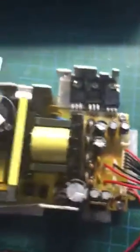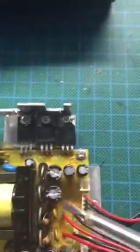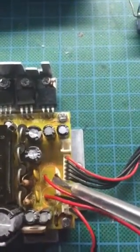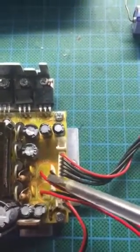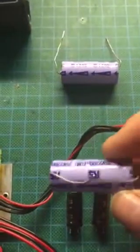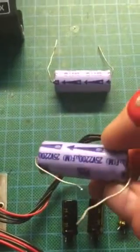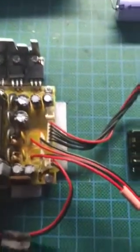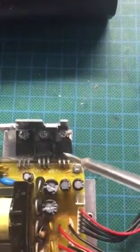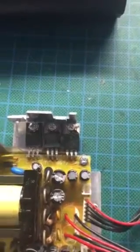What I've done is swapped out this cap and this cap, and I'm doing a mod on these two larger caps, which are 1000µF. Since I haven't got any, I'm going to swap them out for something a little bit larger — these are 2200µF 25V — and I'll just mount these on the outside with some heat shrink sleeve on them. It should help calm it down a little bit. Here you've got your 5V regulator, and then there's an NPN and a PNP transistor which are for generating the reference for the plus or minus 15V.